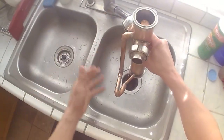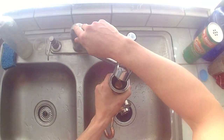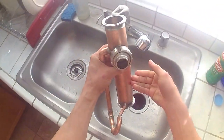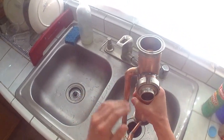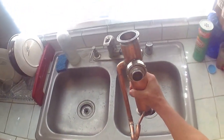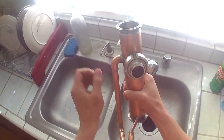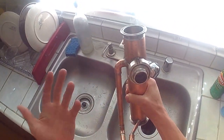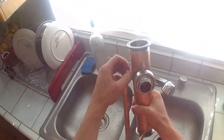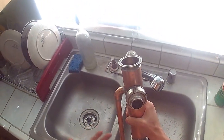So now you have the thumper primed. There's no fluid in the whole column. You can add a tiny bit more. Now you have a primed thumper with just a little bit of fluid in it. This is great if you don't want to have boiling water coming through your drain and heating this up. It's a good way to make sure that your thumper is working properly and that you've primed the drain properly. Personally, I liked having it filled up to here so it gives more of that thumper effect. The issue with that is you will get boiling water coming down the drain and it will be hot — it won't boil, but it will be hot, so you need to be aware of that.